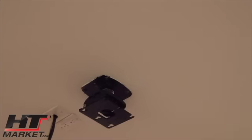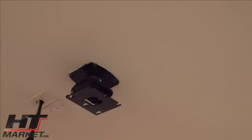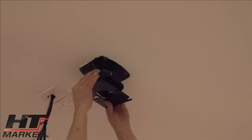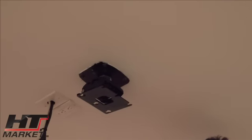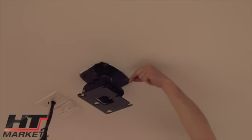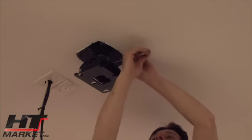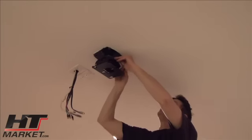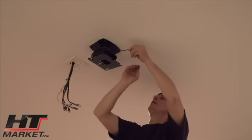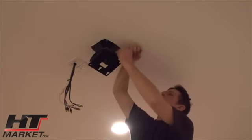Make sure it's oriented to the front of the screen. This is already centered on the screen from when Jim did this seven years ago with the other projector. You always have to go dead center on the screen, although there is a keystone adjustment if you can't hit dead center — but getting pretty close is ideal. These RPA mounts have a lot of adjustments in them. Now we're going to tighten up this set screw that holds the mount on the pipe.